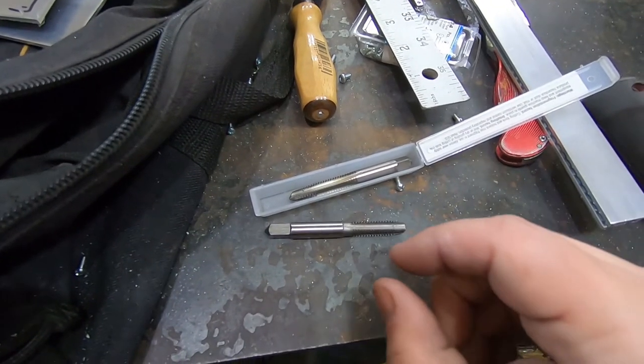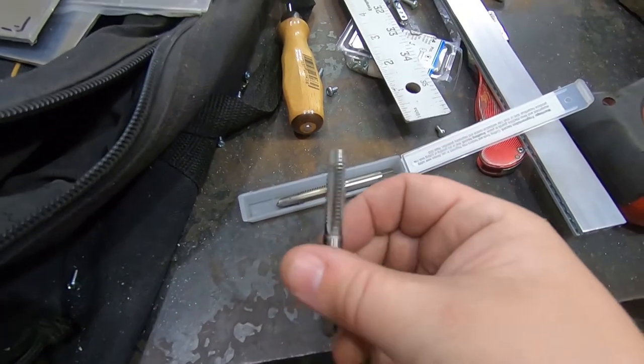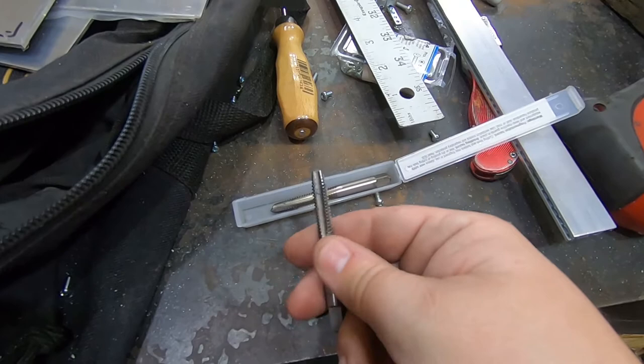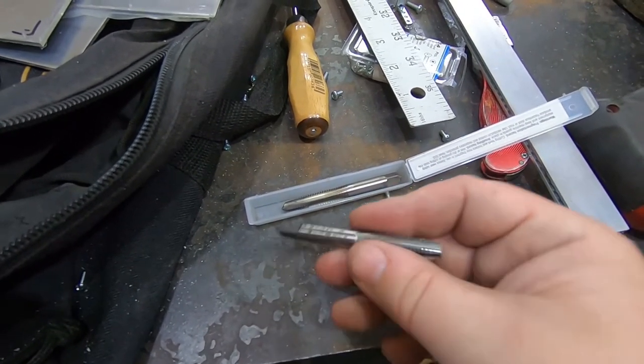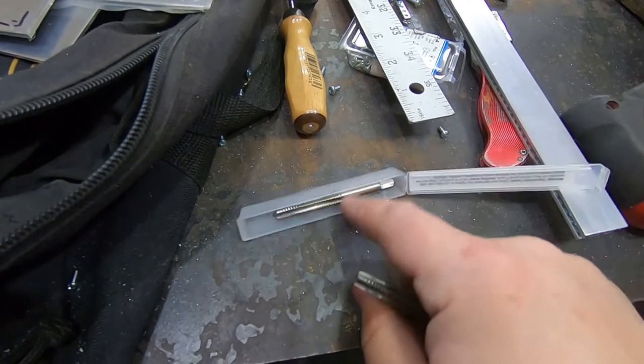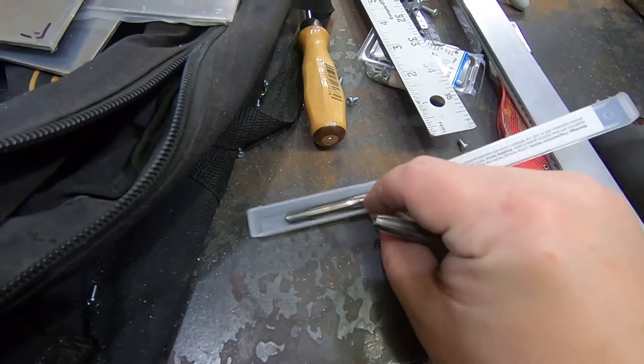Thumb wheels have to have fairly shallow tapped holes in them, and unfortunately I just have 2 taper taps in 5/16-18. I should have considered this when choosing which size. I just kind of randomly chose this early on. I didn't think it through, and I should have.